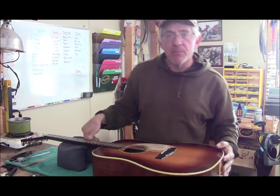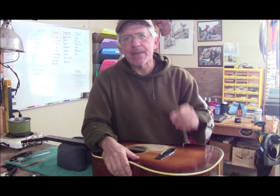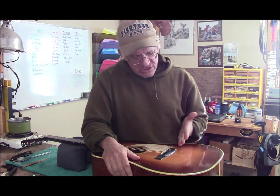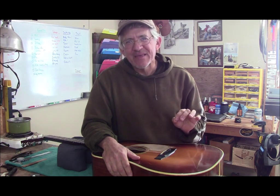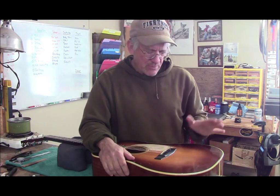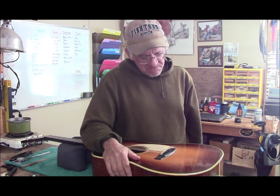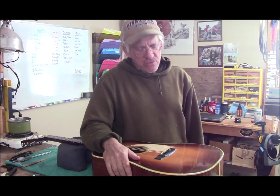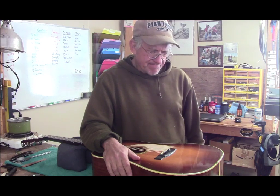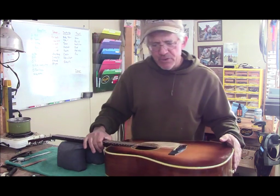You know what I would do, and what I'm probably going to do, is either leave it alone, or take some shellac and finish polish it in there to protect the finish. And the beautiful thing about shellac is it's going to stain it almost perfectly. It's like a chameleon. It comes in here, and it'll stain this, and you'll be able to see it, but it won't have that white visible look to it. It'll protect the wood. Those are honest battle scars. I'm not going to do a lot, but I would personally shellac those in just a little bit. It'll blend good. Okay?